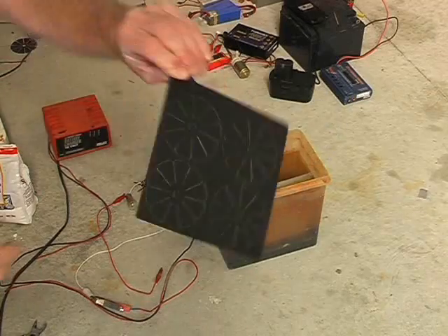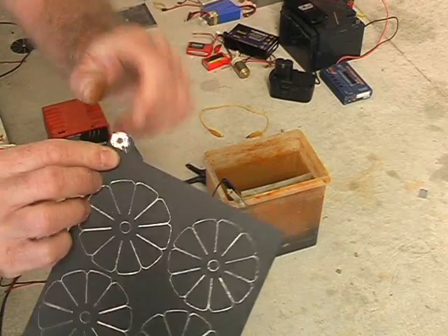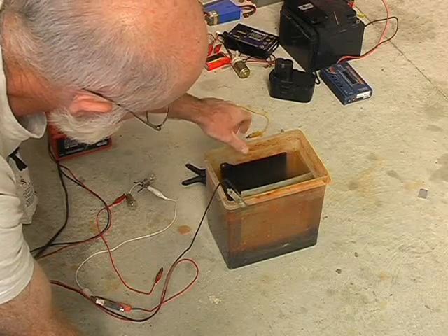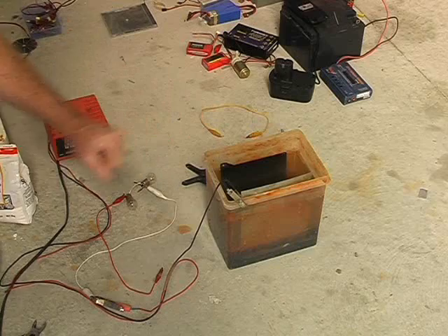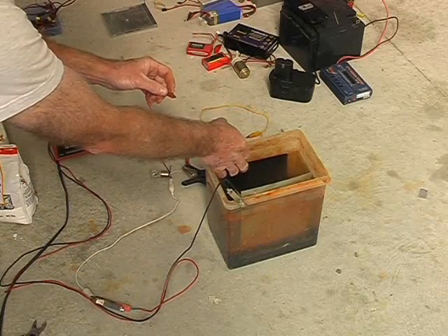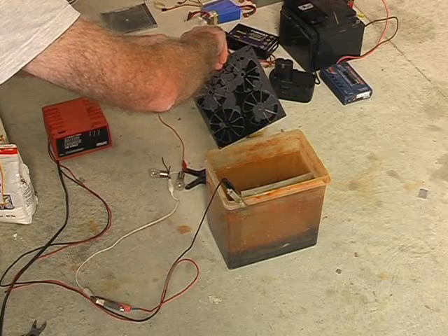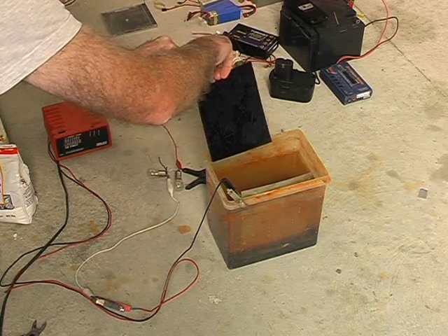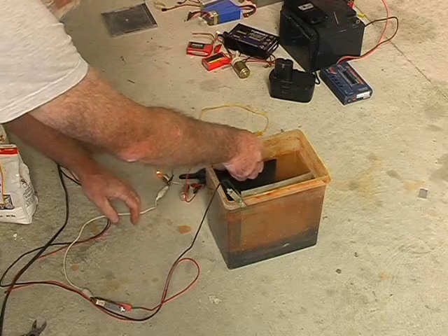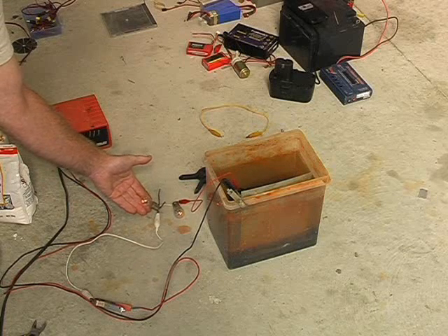We take our spring steel with the valve pattern marked on it. On the corner I've scratched away some of the paint so I can hook up a crocodile clip. I'll immerse this in the solution — it goes right to the bottom, just enough left on the top for me to hook my crocodile lead onto. I drop this back into the solution, and you can see that the light bulbs have actually become illuminated, confirming current is flowing through the plate.